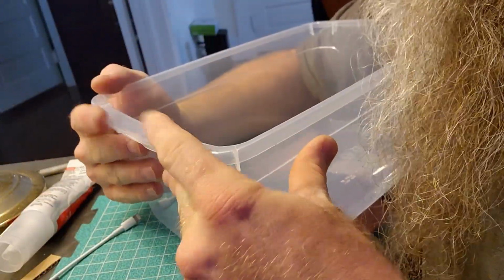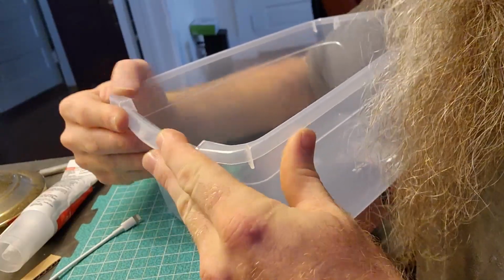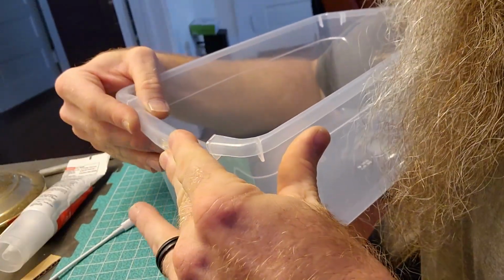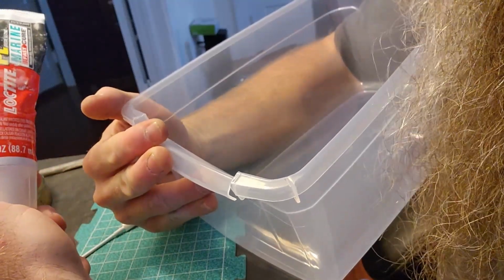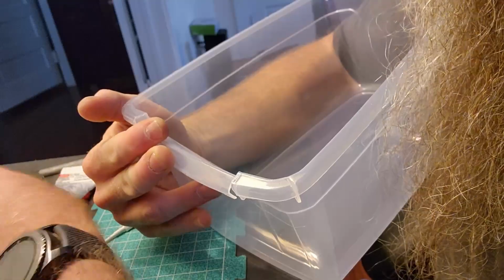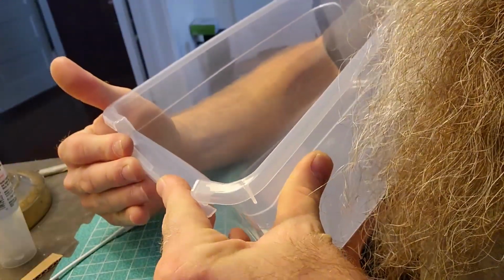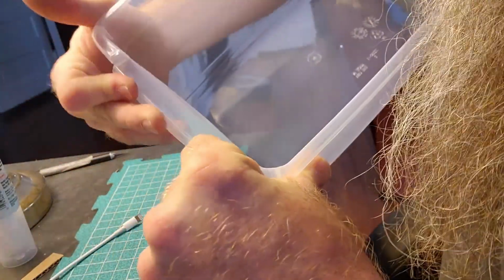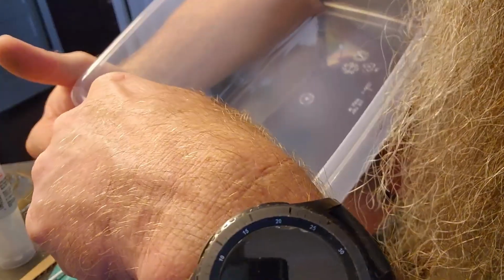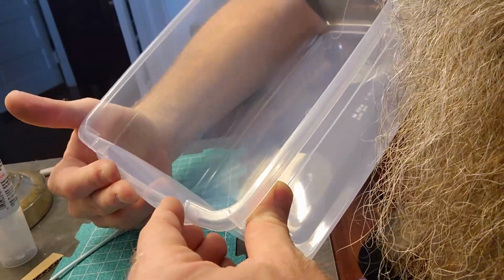And so now, when I heat it up, I'll be able to roll this top over, and that'll force the water to go over that. And we'll take our basically liquid latex. It's an adhesive sealant. So as I bend this down, I'm going to heat it up a little bit, and then when it's done, I'll come in here and throw some of that. I won't take it all the way down to the bottom. I'll leave it up a little bit, about like that.